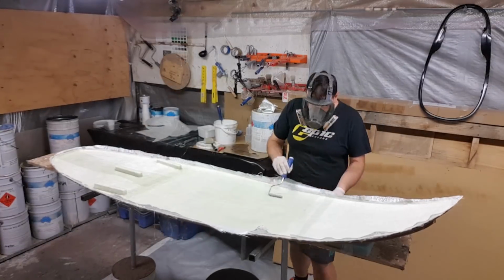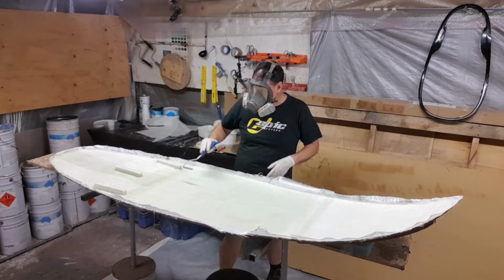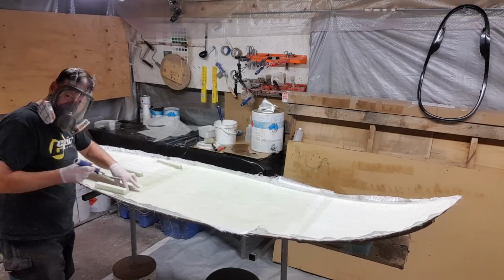Now, I will spend around half an hour to 40 minutes doing these fin boxes with the woven roving, and then I'll add more resin and use my consolidating fin roller again, working from the center outwards to ensure that the air bubbles are pushed to the outside, then dealing with the margins of the hull on their own.